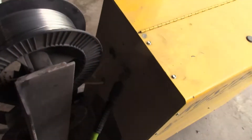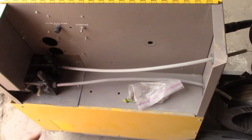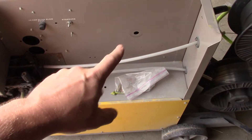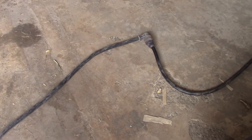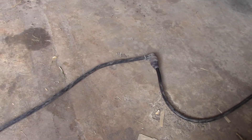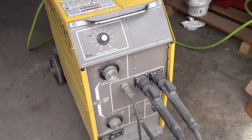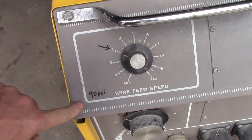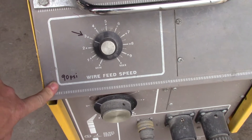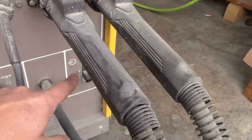There's also Platt Brothers. Inside this case it's basically hollowed out — the wire spools are out here, so you have the dual feed, and the electrical is all hooked up there. You've got a safety fuse and a standard 220 plug — that's two flat blades and a half round — on a 40 or 60 amp breaker. I think we've got ours on a 60 amp. The settings I've got written down: wire speed is 3, 90 PSI on your air supply.